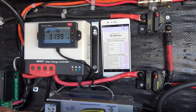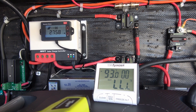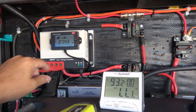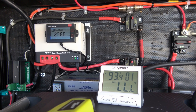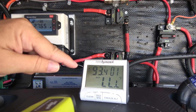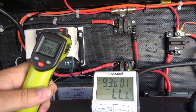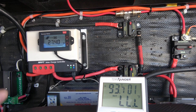I'm right at solar midday now, just a little bit after 1 o'clock. I should be getting 40 amps for sure — the sun is straight overhead and it's perfectly clear blue sky — but actually we're at 27 amps. This thing is obviously throttling it down. My solar panels are probably getting pretty hot too, and a hot solar panel doesn't put out as much, but with 940 watts I should still be able to get 40 amps out of this. So obviously it's throttling down because of the heat. In my compartment it's 93 degrees in the shade. The heat sink shows 126 — it didn't go up too much in temperature but it dropped some more amperage.